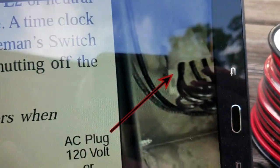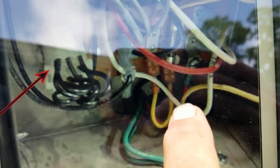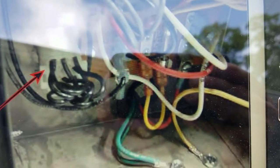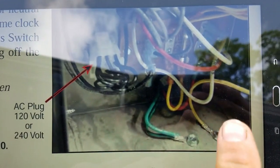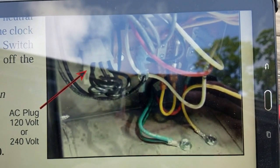The contacts are a pair of jumpers — these two yellow wires. You unplug those and just plug into those with a pair of wires going to your dry contact relay. It's very important that it is a dry contact relay and not a powered relay, as you only need to open and close those wires.